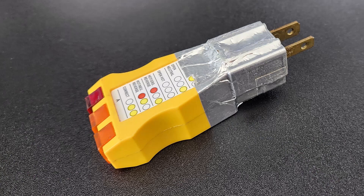These two-lead contact testers are good for confirming that you truly do have voltage somewhere. I love carrying this around in my tool pouch. I don't always use it during home inspections, but there's no substitute for it when it comes in handy. If I'm inspecting an older house that has two-prong outlets, how else are you going to test them? You could carry around a two-prong adapter and plug your three-prong tester into it, but that's clunky. I love this little thing. And this tester does not need batteries — it's always going to work for you until you break it.